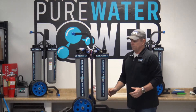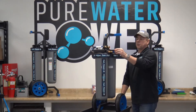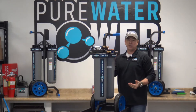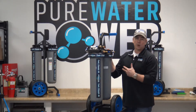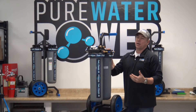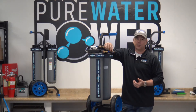This system is equipped with a ball valve assembly that gives you the ability to adjust the flow. Many if not all DI systems on the market today — whether it's a rented tank from Culligan, US Filter, or other competitor brands — water flows in and out at the same pressure or velocity as it goes in, and a lot of times that's overkill. You're wasting your DI water; they spit out way too much water for the efficiency of your job.